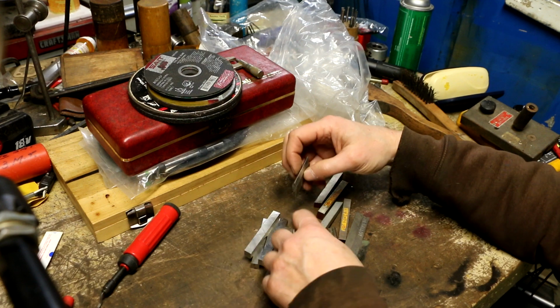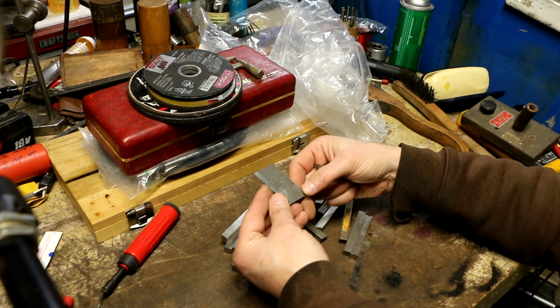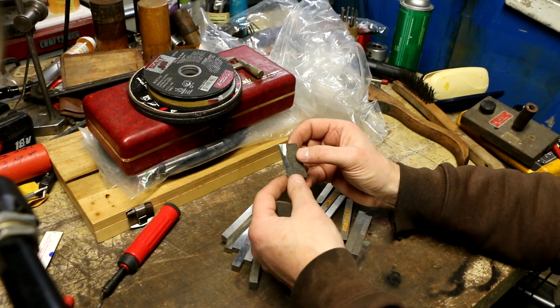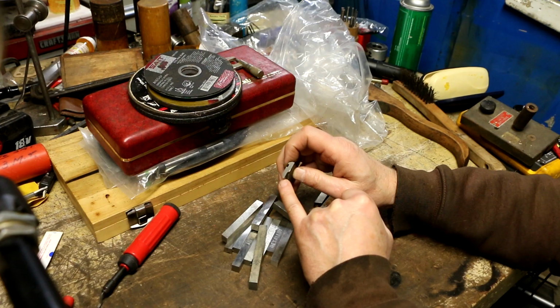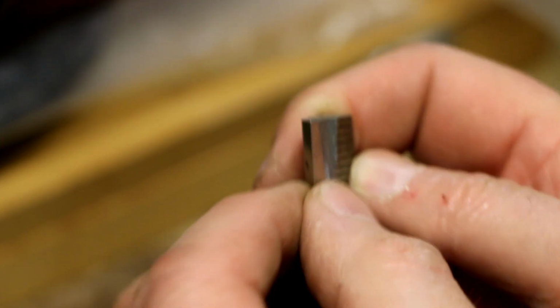Oh, and there's also, you guys know what these are? So this is marked P&W Company of Hartford, Connecticut. I believe manufactured Connecticut, USA or something like that. But anyway, patented April something 19, which would be 1919 more than likely. This has got some grind. Somebody ground a relief on this one for something. But this edge right here is a 60-degree angle. This is for threading.